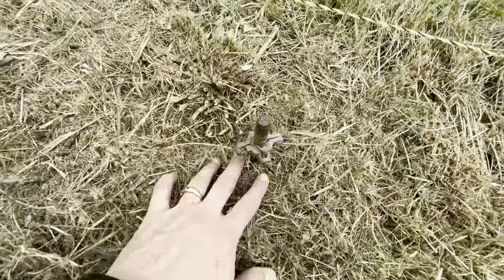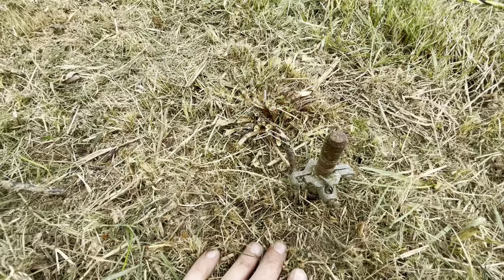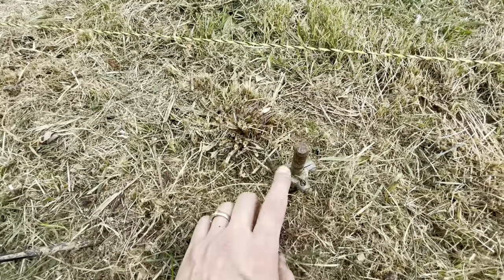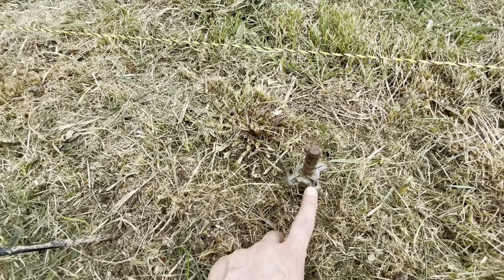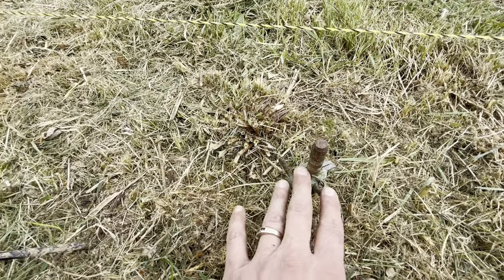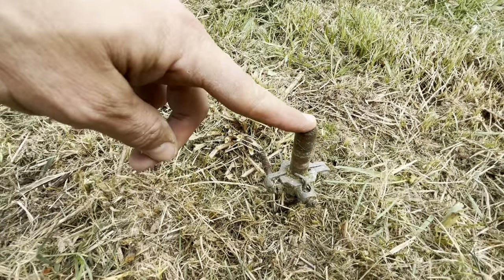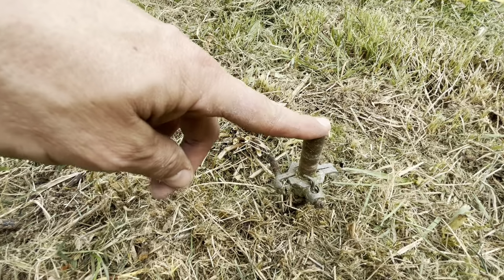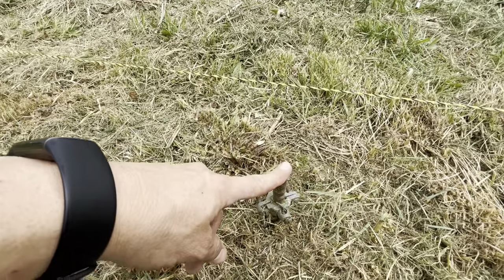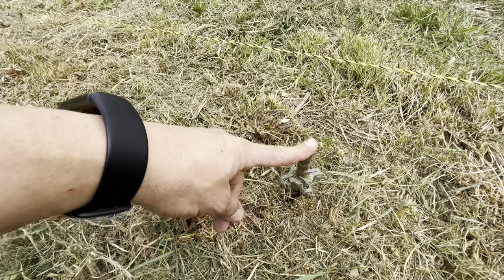This is an 8 foot long ground rod, 6 or 8, I don't remember. Maybe it's only 6 feet. If you guys watch Blue Cactus, you'll see Derek go out and pour water on the ground on this, because their ground is so dry that there's no water. So this goes far enough down in the ground that it always has moisture conduction. I don't know if that's the right word, but this grounds the fence. And in order for the fence to work properly, you have to have a ground that is contacting moisture.